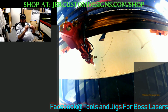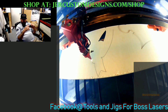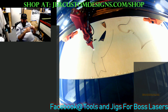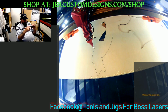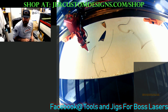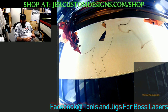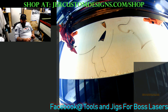So this cutout, like I said, is half inch birch plywood, and I'm using a 4-inch lens with the large nozzle, and my distance is 10.8 millimeters away from the substrate. Running the 150 watt laser at 80% power at 8 millimeters a second typically gives me a nice golden brown edge.